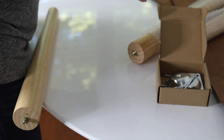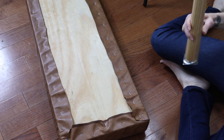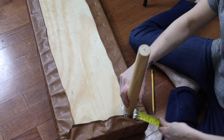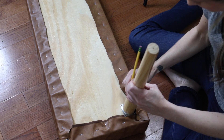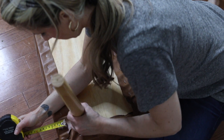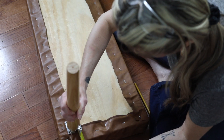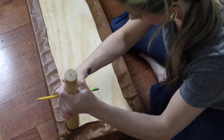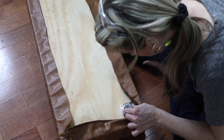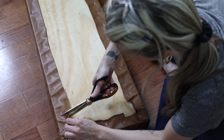The thing that made this project so quick and easy was that I ordered prefabricated legs from Amazon — I will link to them below. I ordered some mid-century style legs, which made this such a quick and easy semi-homemade DIY project. Of course you can make your own legs or add any style you want. I also ordered some angled brackets to attach the legs to the seat, placing them about an inch and a half in from each edge, marked the holes, pre-drilled, and attached them with the screws that came with them. I did cut away a little bit more of the leather to make room for the brackets.